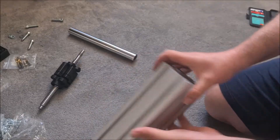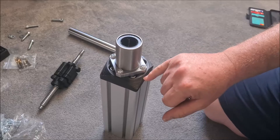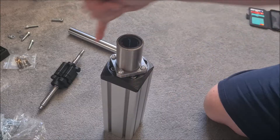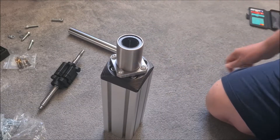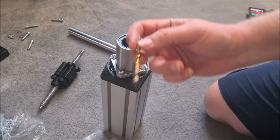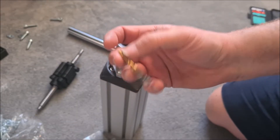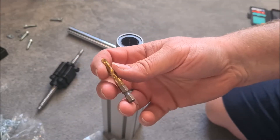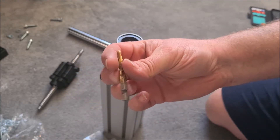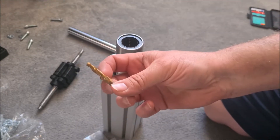On this end I've put the linear bearing onto the end cap, which required me to tap the end cap in four positions M6. I used my favourite new tool for that, which is a tap set you can get from Amazon - I'll put the link in the description. It comes with these twin nitrided impact driver bit taps. You have to go a bit careful when tapping into plastic, but so long as you're careful it saves you loads of time.